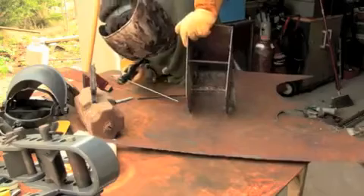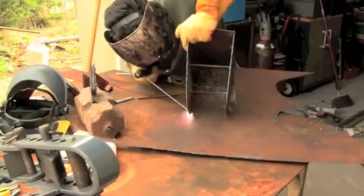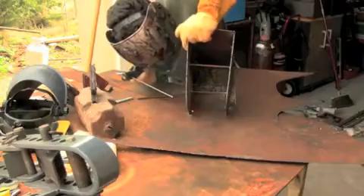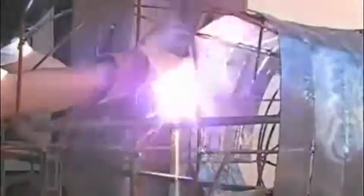Stick is being used on this piece to build up a form by cutting the side pieces to mirror each other and then rolling up a piece that will later be trimmed with plasma. Here's an example of building up an armature with rod first and then creating a form out of strap material over the outside and tacking it in place.